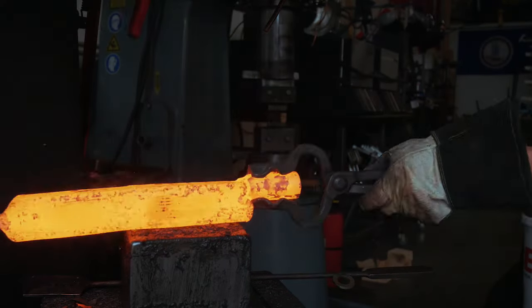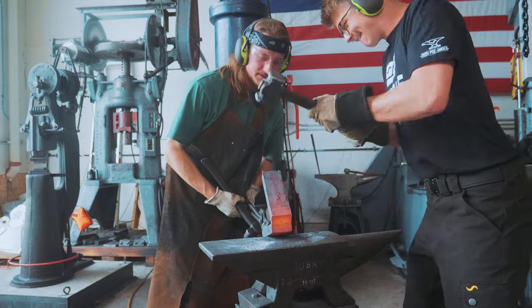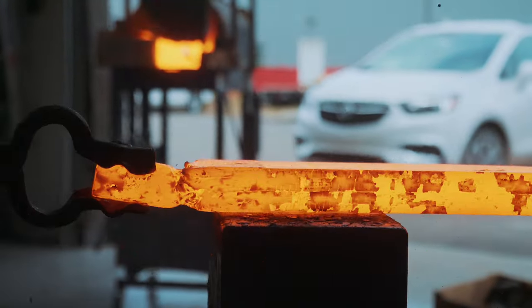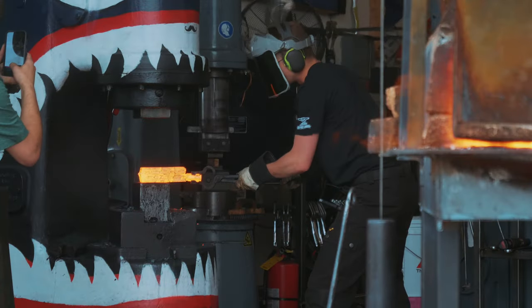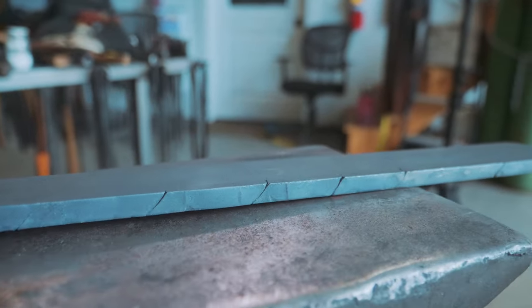So we started making the Damascus, but then I got lazy. I'm very embarrassed to say I started doing what I knew I shouldn't have. To build up the layer count for this steel Damascus that we were going to put the copper into, I did a hot cut fold and re-weld. It worked fine for the first few, but then eventually it didn't weld — I couldn't get the surfaces clean enough while I folded it over hot. The weld didn't take and we ended up with a billet of steel that is cracked really badly. So in my rush to experiment with this copper Damascus, I've been bit by my own ticks and fleas, which means a day is wasted.